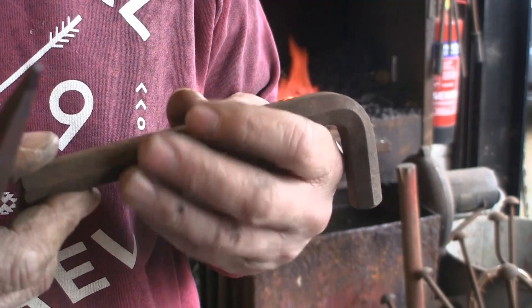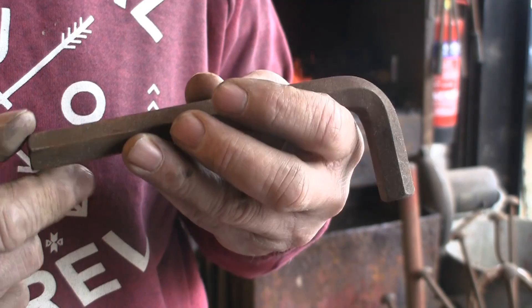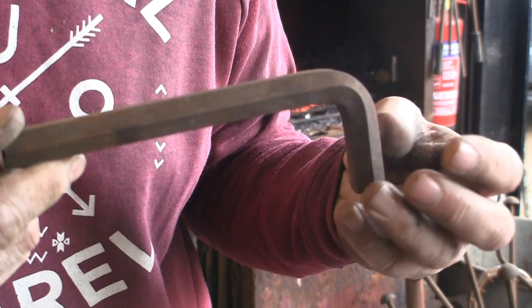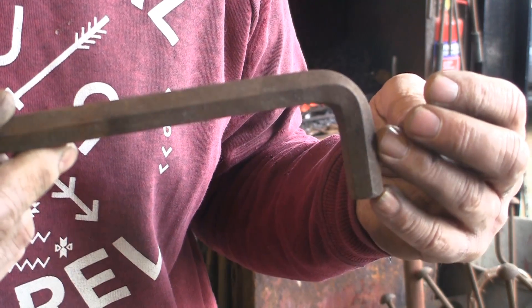What I'm going to do is forge it out of another Allen key. They're both the same size — that's what this one was. I think it's a nine-sixteenths. So I'm just going to bend this straight and then forge the end out into another point.